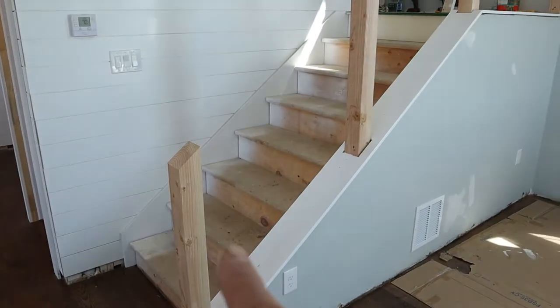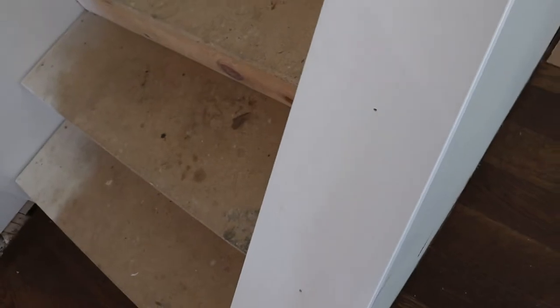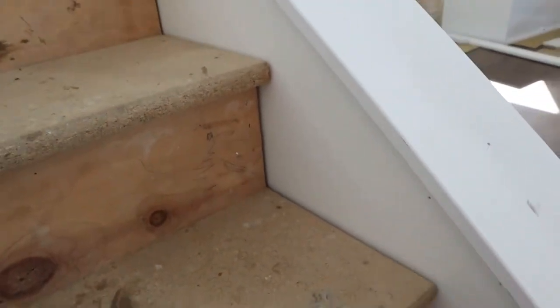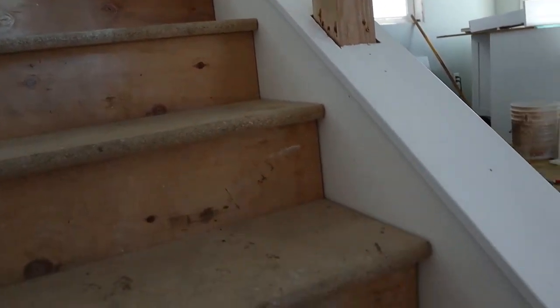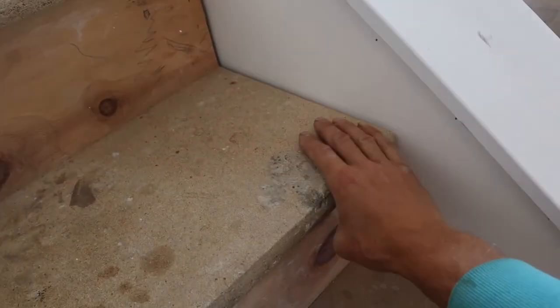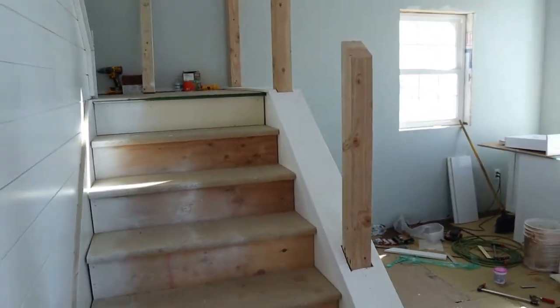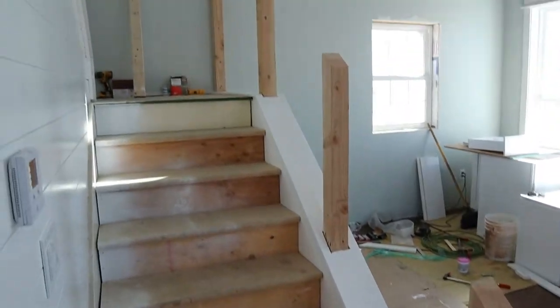I got these posts on now. The one by eight caps it out really nicely, and on the inside you got this one by twelve, and that's kind of how it looks. It gives it a nice finished look - it'll get some caulk and paint wherever my nails are. It just lets the carpet go up to it and keeps this kind of traditional look. I think it looks really good. So now we can actually move on to building the panels for this railing.